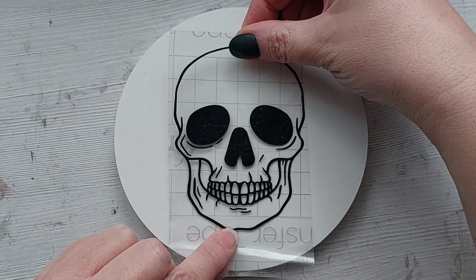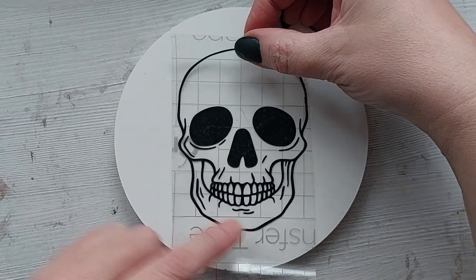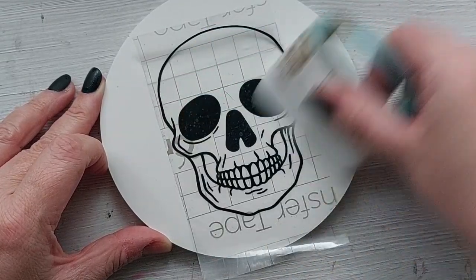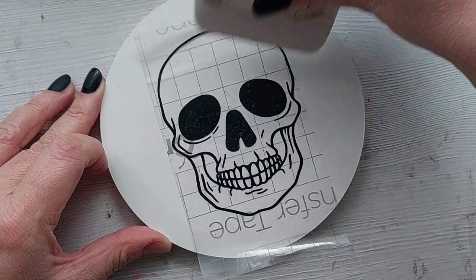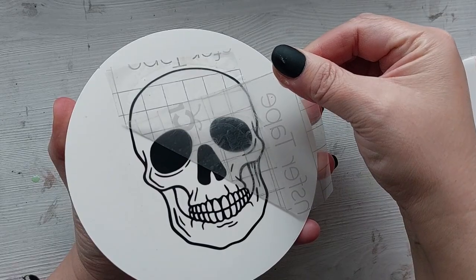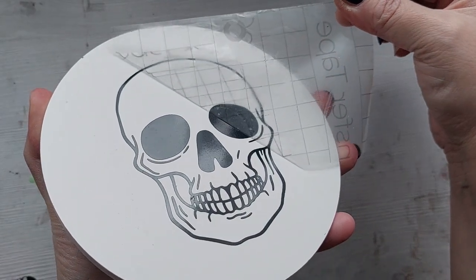Okay, this is 24 hours later. Before applying any vinyl or sealing your Jesmonite, you really should wait the 24-hour period. This is to ensure that any moisture left in that Jesmonite has had a chance to come out, and you know that your vinyl is going to stick and that your sealer is going to do its job instead of trapping moisture inside the piece.